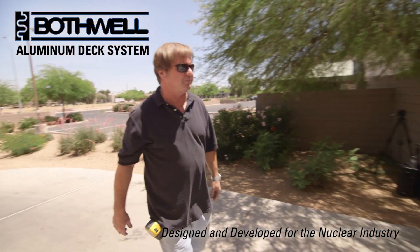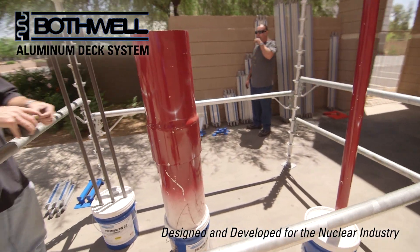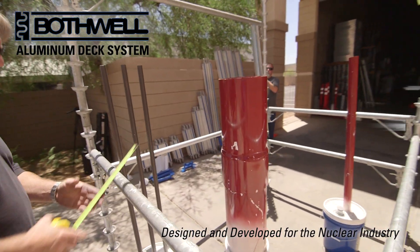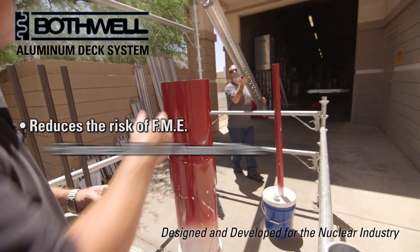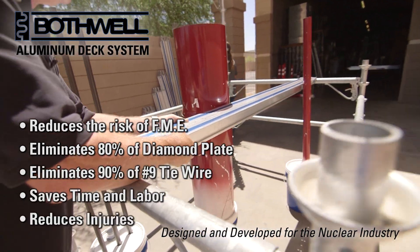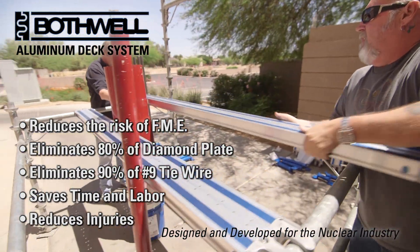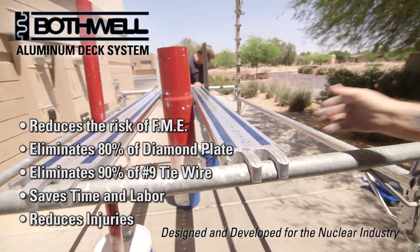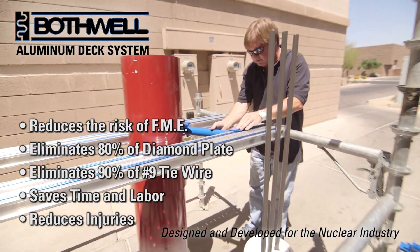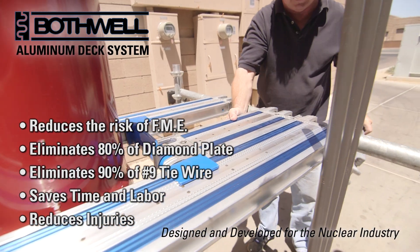This is a smart mock-up of what you typically see in a nuclear plant with some obstacles of different size. We're going to start by going around a 12 inch pipe with some 6 inch wide plank that would fill these gaps. Once we straddle the plank, we're going to use a 12 inch float bar, rather than diamond plate, which twists right in effortlessly, and two 6 inch wide plank, a foot and a half long.